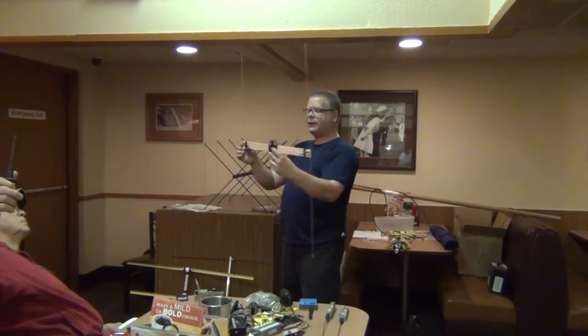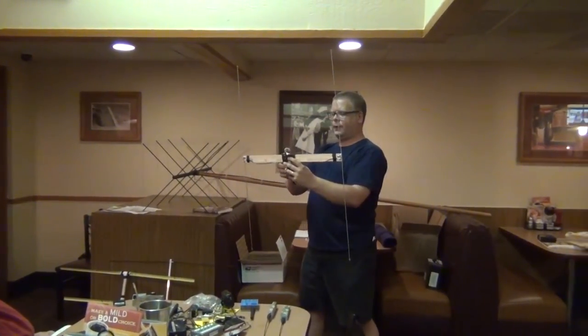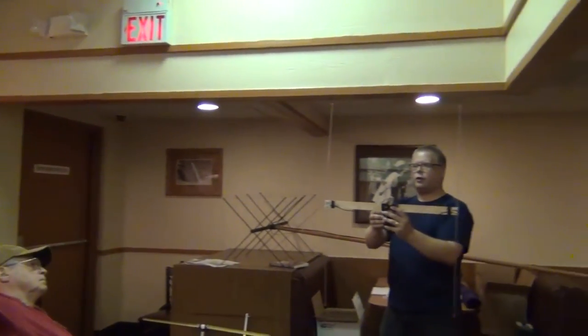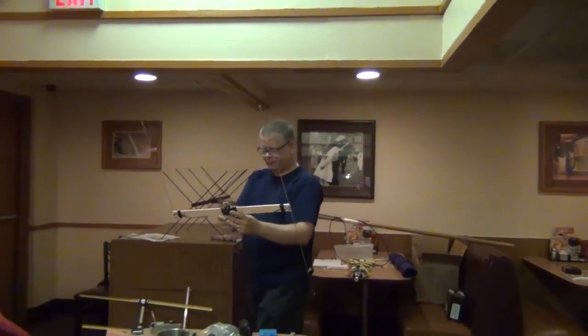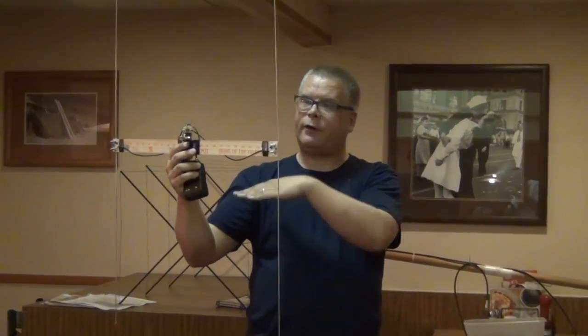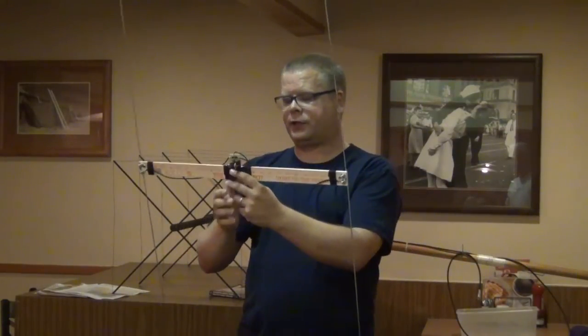So what you can kind of hear is, I think it's in the room, it's not doing so well, but what you'll find, I think without so many reflections, is when you're like this, you'll hear that tone, and it tends to kind of fade away. This one is getting more multipath as it comes in, and then it gets stronger when you go this way. Although it'll work a little bit better outside, generally the idea is you swing this thing around, and when your antennas are equidistant, that 500 hertz tone goes away. So you just listen for that tone, adjust till it's gone, and now you know that your antennas are equidistant, and you can hopefully head in the direction of the T.